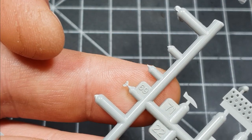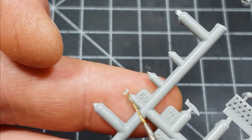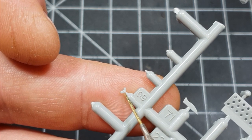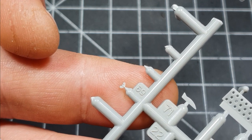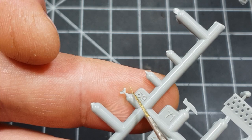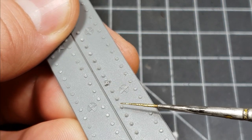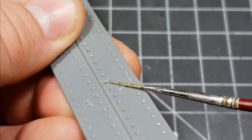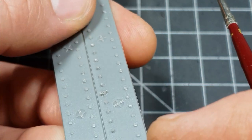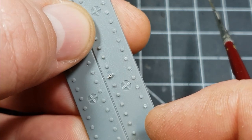Now for the wing nut, I wanted to actually put that over the rod. And the only drill bit small enough to go through the middle of it was 0.3mm. So that's why I chose that particular size. After a couple of attempts, it wasn't really working, so I went a different way and I've drilled through one of these bolt pieces, and then I've cut the sides off the wing nut and stuck them on there, so I'll be able to cut this off and then that wing nut can go over the rod.